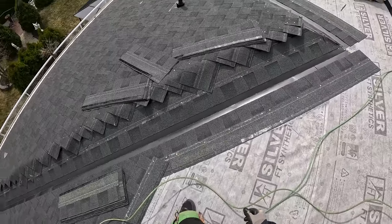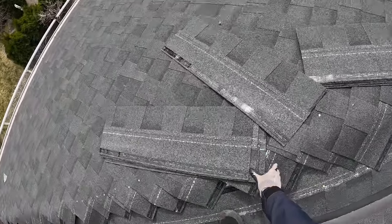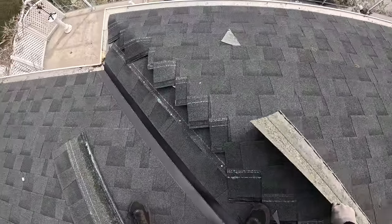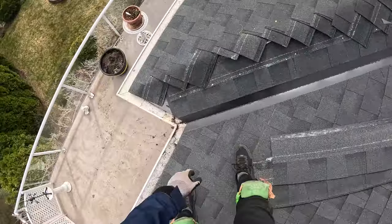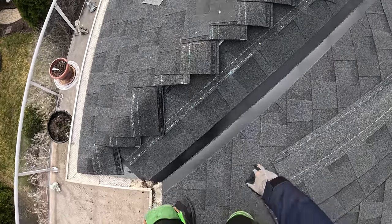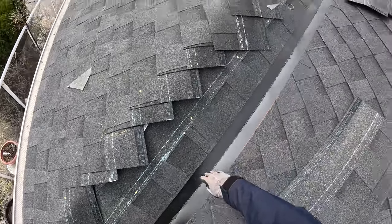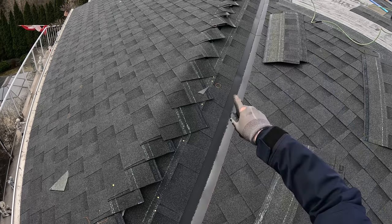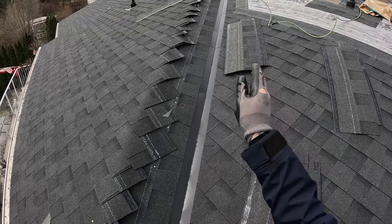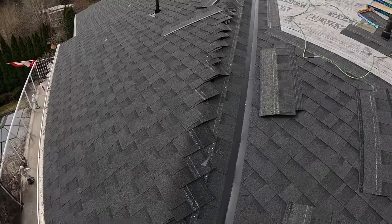Coming up these little hips can be tricky to keep your shingles straight, so you're lining up top. A little thing you can keep in mind when you're doing them — you're obviously going to start off your eave, but that's hard to keep consistent all the way up. So you can use these as your reference. These lines line up perfectly with that hip, so this will give you a straight run all the way to the top. If you have this side filled in, you can use that as your guide because it will pretty much follow the hip all the way up.